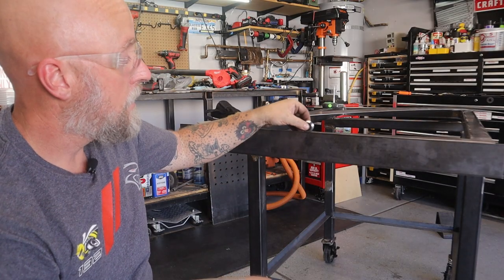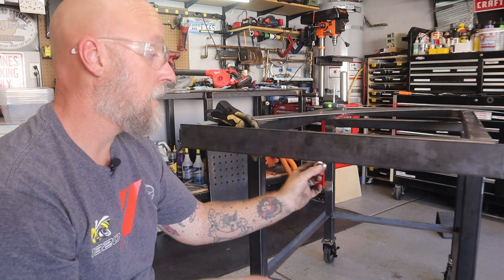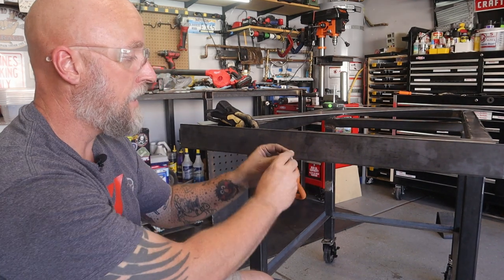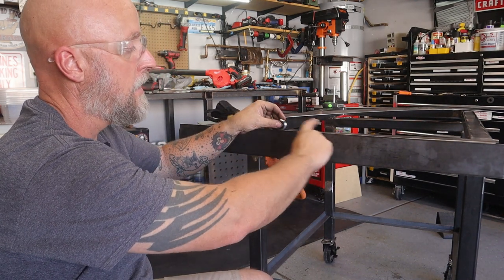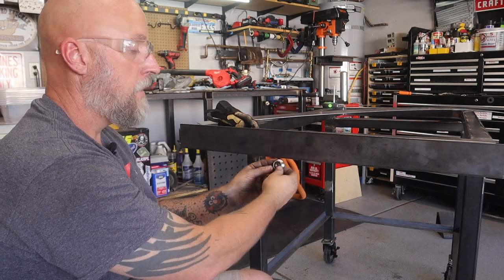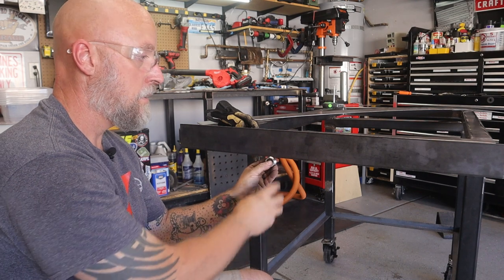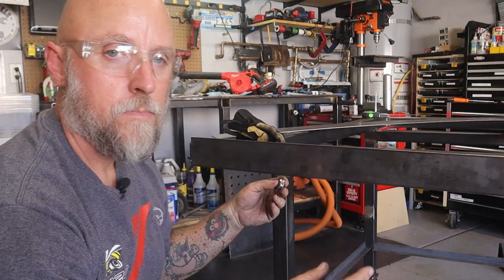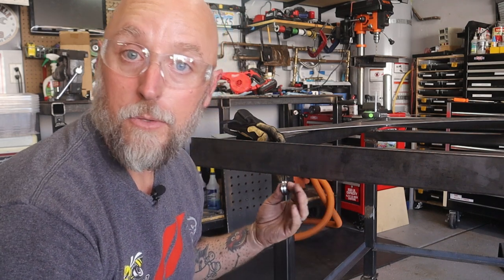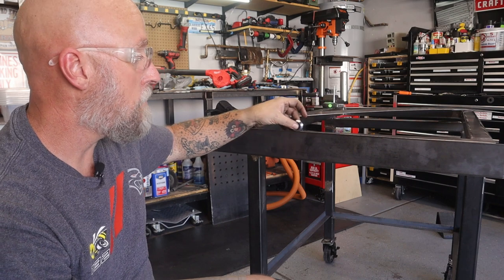That's why I don't mount it with magnets, for demonstration purposes only. The bearing will ride along this top rail, top and bottom. I'm gonna come up with a way that there's gonna be 4 bearings, front and back. One in back, one in front, same top and bottom. And the bottom ones are gonna apply just some extra pressure to the rail. I'll figure that out when I get to building the gantry. But overall, this is gonna be my rail system